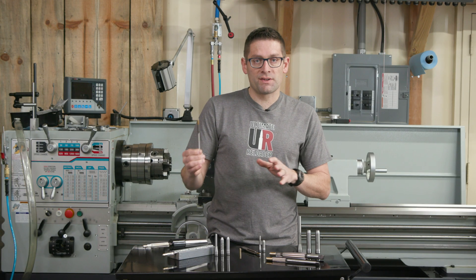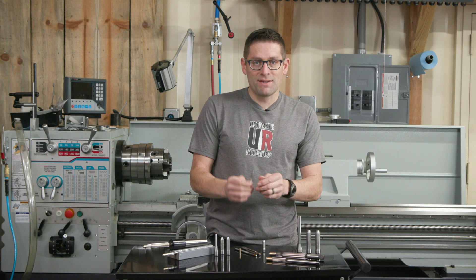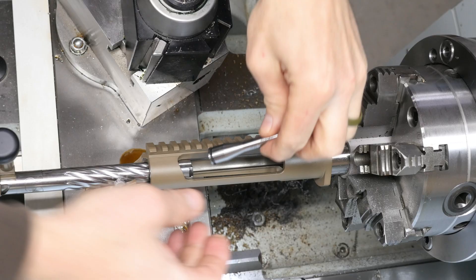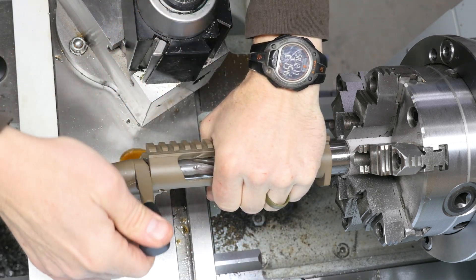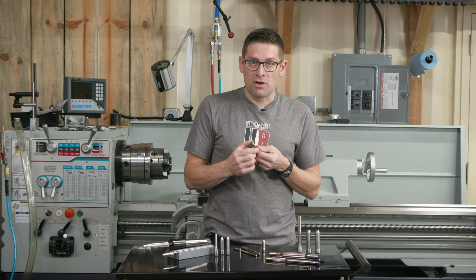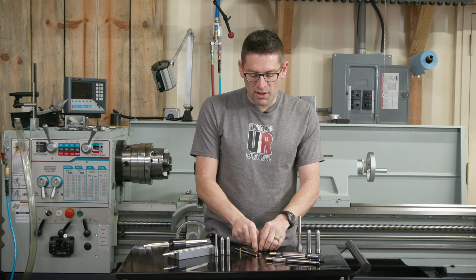You can then separately cut your free bore, which is great if the customer you're building a rifle for wants to use different bullets and loads — you can dial that to exactly where you want it. You use the lands gauge to test this. The way these gauges are dimensioned: you put it into the bolt, drop the handle with the action tightened down, and it should pass if it has proper free bore specification. You can also cut deeper, or if you want to cut it shorter, compare your reamer stick-out between the lands gauge and your go or no-go gauge.